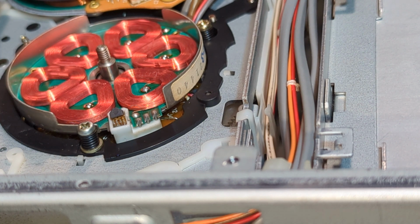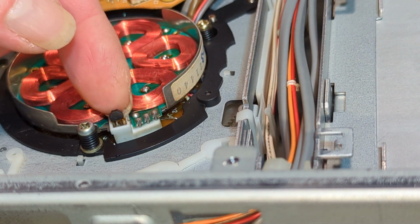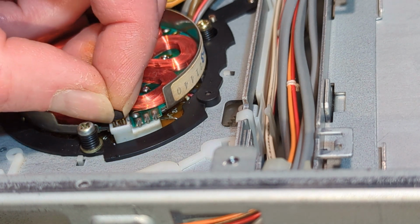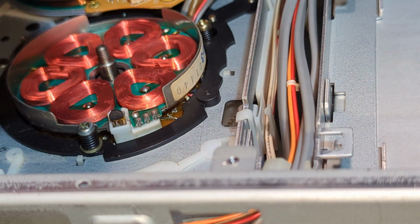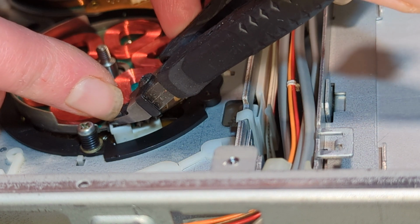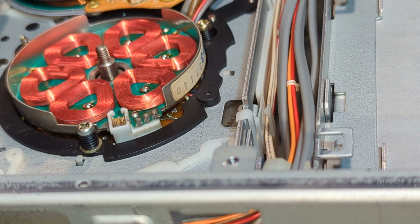it came out pretty cleanly. There's actually still quite a bit of glue around it. But anyway, it needs to come out, so let's take it out and relieve as much lead as possible. I think that's got it, there we go. Now another thing I'm a bit concerned about, because it is quite contaminated, the glue has actually rotted the legs, and how well the solder is going to adhere. But yeah,